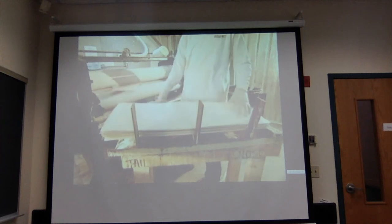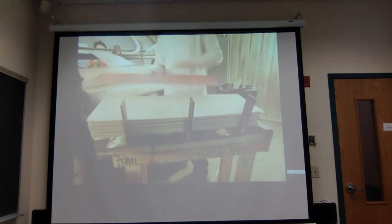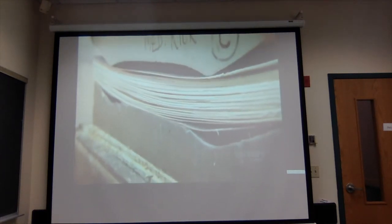The inside sheets go through the glue spreader, which saturates both sides. This adhesive is specially formulated to withstand vibration and shock. Workers then stack 35 sheets of veneer — the equivalent of five skateboard decks — and place them in a mold.